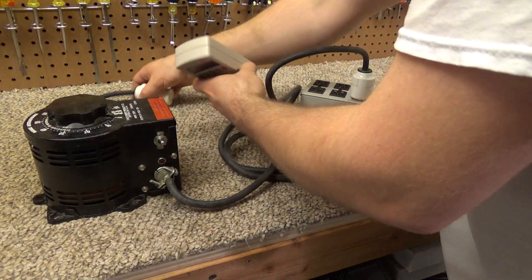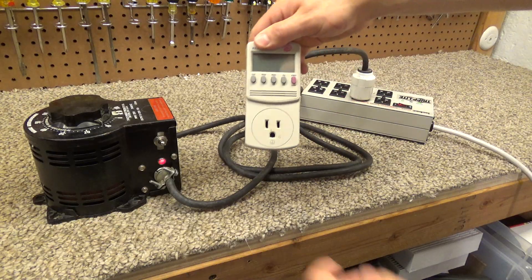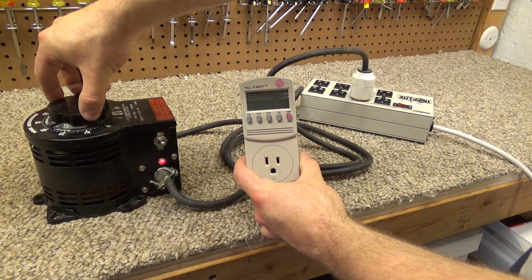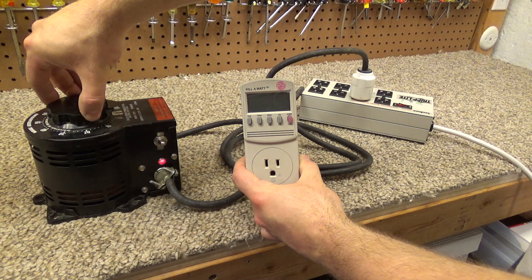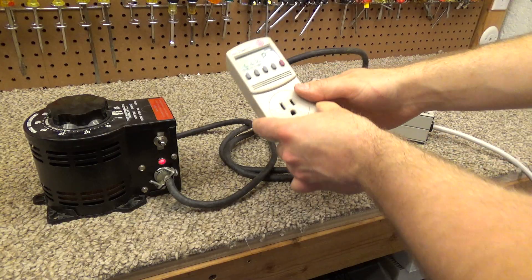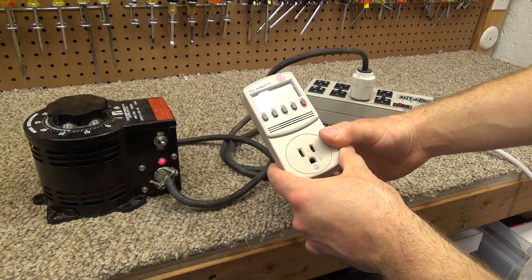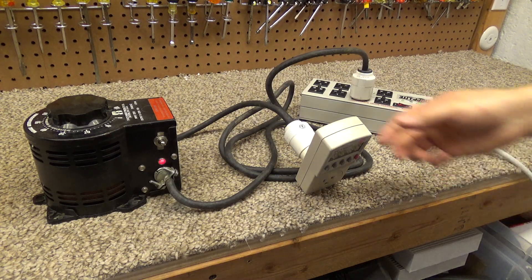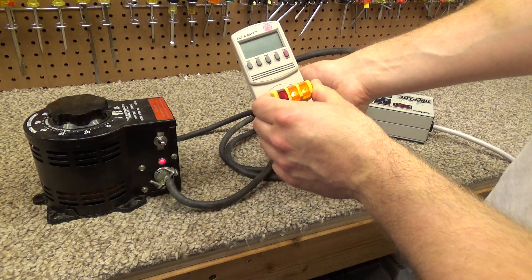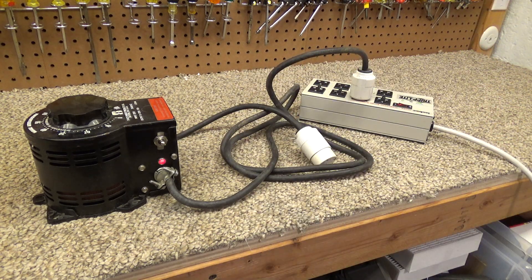Okay, that all seems reasonable. This won't read any voltage until we probably get upwards towards a hundred or so. Hmm, well that's not good. Unless the fuse is blown — but then there should be no power, I would think, if the fuse was blown. Well, it's got power — is it just not giving out enough voltage? Let's plug in a fan and see what it does.